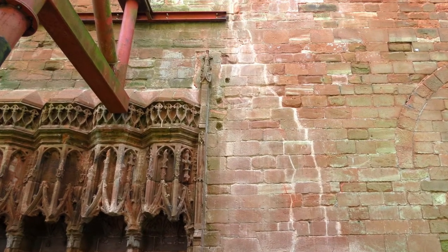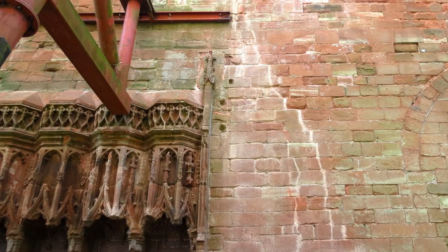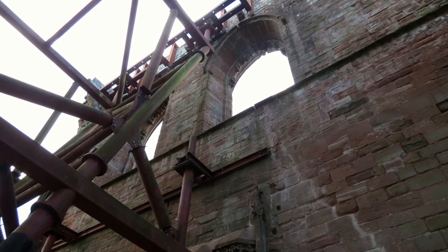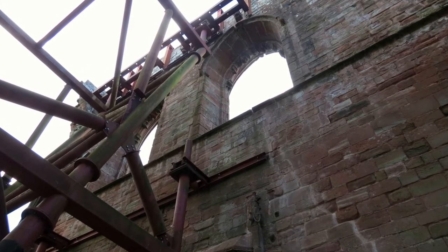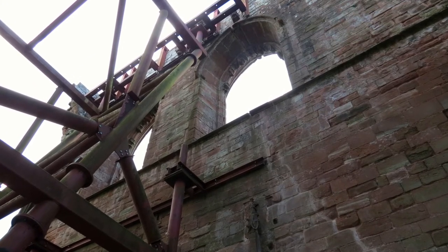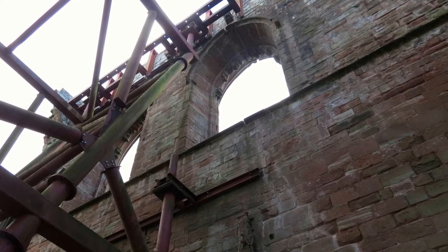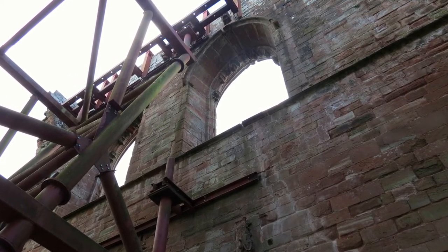As the ground conditions change, all buildings move. As the moisture content changes, all the walls will move. But on the windowsill there, there's still a monitoring point in place, and that electronically monitors the difference where the crack is. But obviously now the crack's been sealed, that shouldn't move again. So back in 2008-09, when you first started working, what was this wall sitting on?